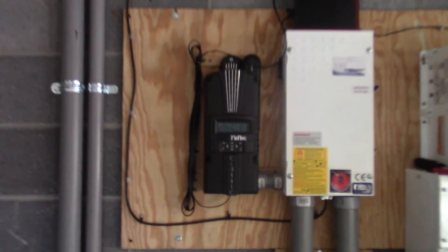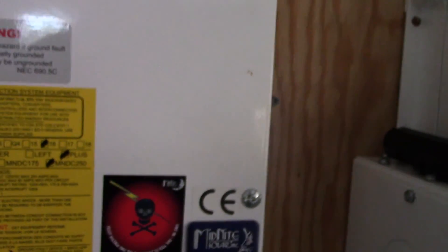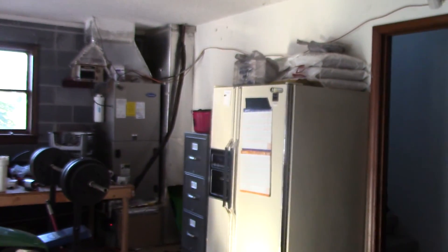I've got four additional batteries, but currently we've got 89% battery and we're charging at 800 watts. This inverter is on and running. The fan has turned off for the day on the timer, and this refrigerator we're going to go ahead and shut down for today.